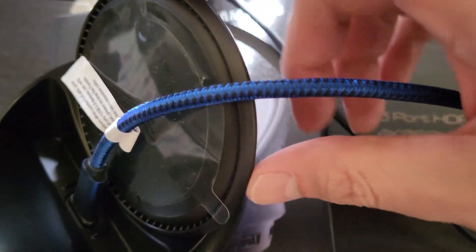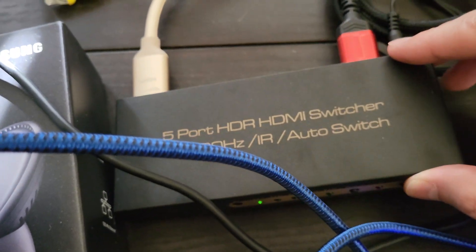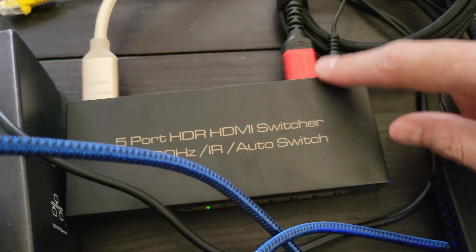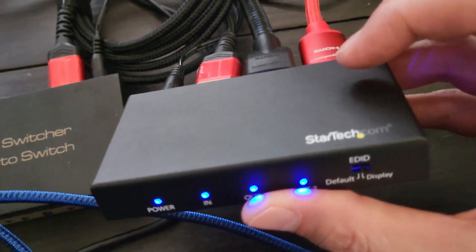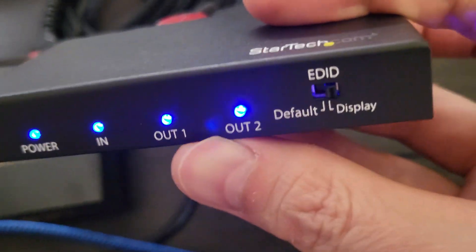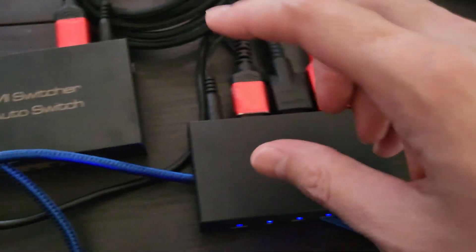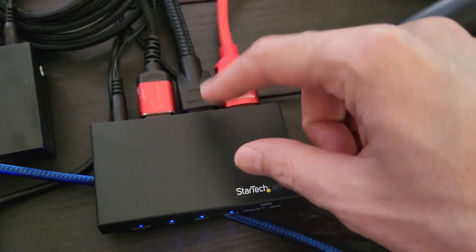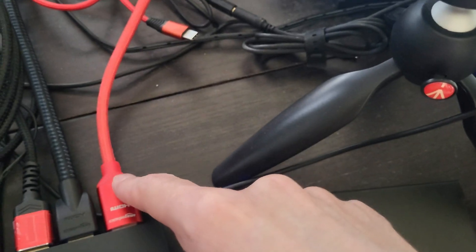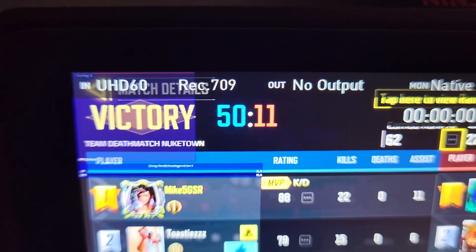From the DEX station made for a cell phone, I've got the HDMI routed into a switcher — that's input number one, then this is the output, and I'm trying to trick the signal. I'm rerouting the output signal into the input signal on a StarTech switcher. You can see I've got the EDID set to display. This black cable is going to that television. Once you power everything up in a certain order, so it's reading the EDID off the television, it should be able to output this signal into the Atomos Ninja in 4K 60 — you can see right there, Ultra HD 60 FPS.